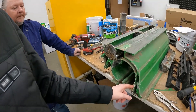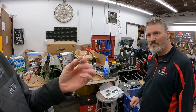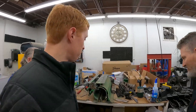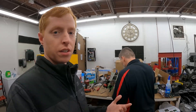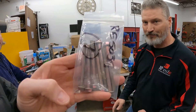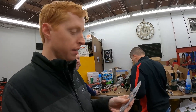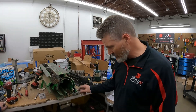Yeah, I have to. These are stainless bolts, and what they do — even if they're not corroded — stainless and aluminum don't mix. So they corrode together in there. Did you know that stainless and aluminum together is very bad? We supply steel ones in our kits now and I think Deere switched to that too — they're like a hardened steel, so steel and aluminum are okay together. Several customers have told us they'll just weld the nut on and they've been able to get them out. These are the steel ones we supply — grade 8, or grade 10.9 in the metric scale, which is equivalent to grade 8.